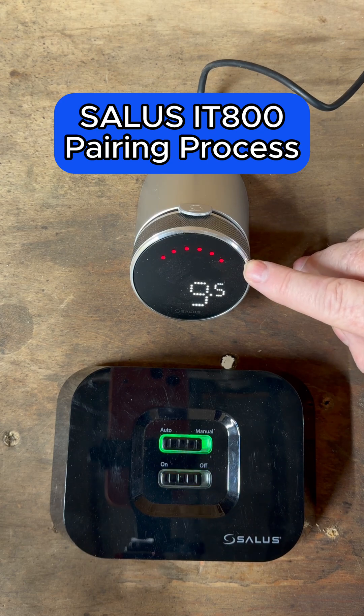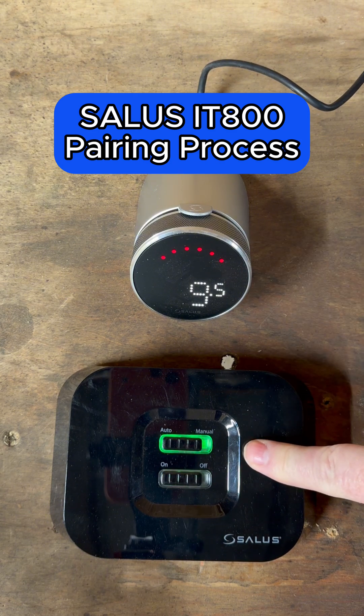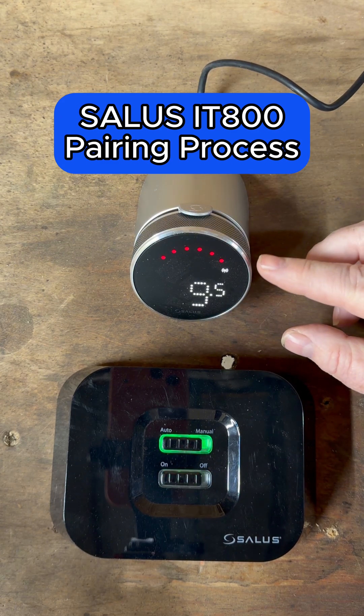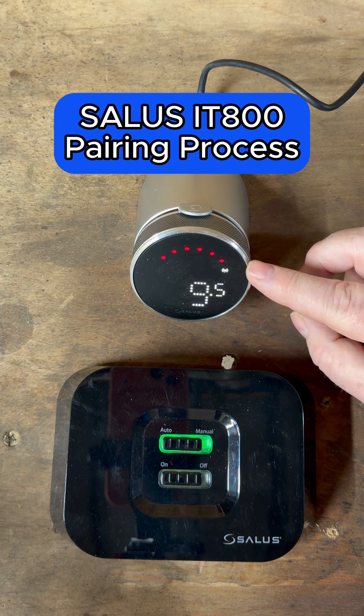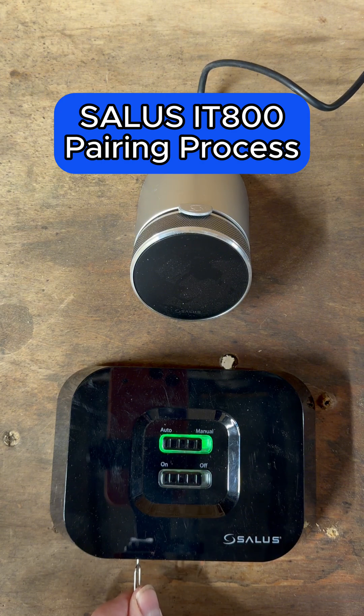Click the top button again on 'Yes' and it'll now do a factory reset. You'll then see the symbol on the thermostat starting to flash — this means it's now trying to connect to the receiver. You can now see it's got a solid light on there, so it's now connected to the receiver. Go back to the receiver on the underneath left-hand side.